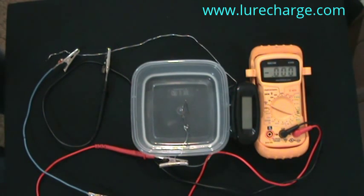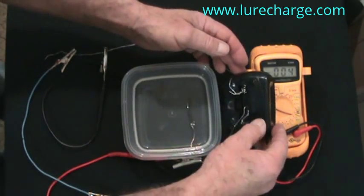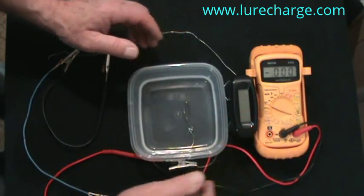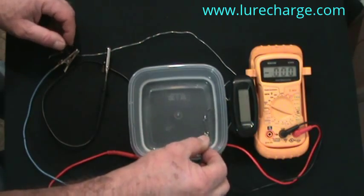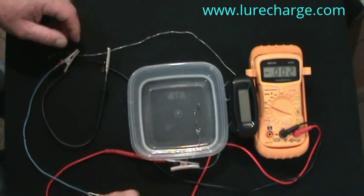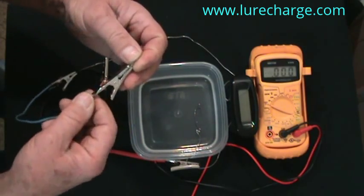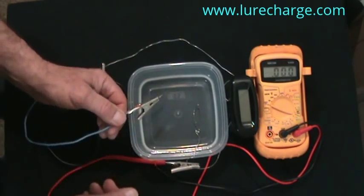To start with a brief demonstration for the skeptics. Here's my little digital clock with the battery removed — it takes 2 volts DC. On the positive side I've wired in a stainless steel hook on soft aluminum wire. On the negative side I'm using one of my hotter anodes. The electrolyte is salt water taken from the Strait of Georgia.